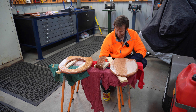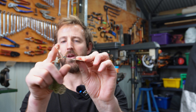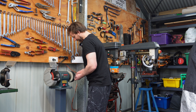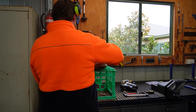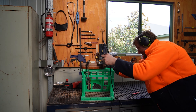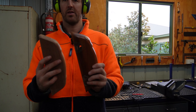Then I just varnished the seats. I've got some hardware — a three-way hinge for the toilet seat: one part goes on the toilet seat, one goes on the lid, and one goes on the back brace. I polished these up with the buffing wheel just to make the whole thing look nice at the end. For the back stop, I did a rough cut with the jigsaw, then traced the profile with a straight cutter in the router. The straight cutter wasn't long enough to go all the way through, so I traced it one way, flipped it around, and traced the other way — this worked really well. I then went back and traced the seat and lid to get a nice consistent finish.